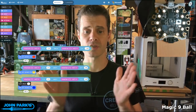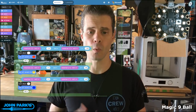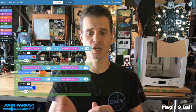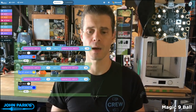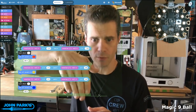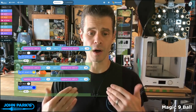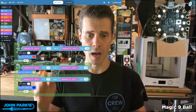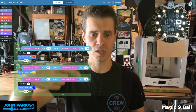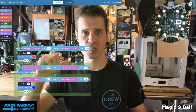I have a forever loop running the whole time, and inside of it I have three little while loops looking for sets of rotation angles. I'm reading the rotation degrees of roll based on how I have this oriented, and through testing I found a band of numbers for when it's tilted forward, another range when it's laying flat, and another when it's tilted back. I've added the USB mouse extension to this MakeCode program, so while it senses that I'm tipped forward it turns the mouse wheel one unit in the negative direction, and the opposite is true when I tilt it back.